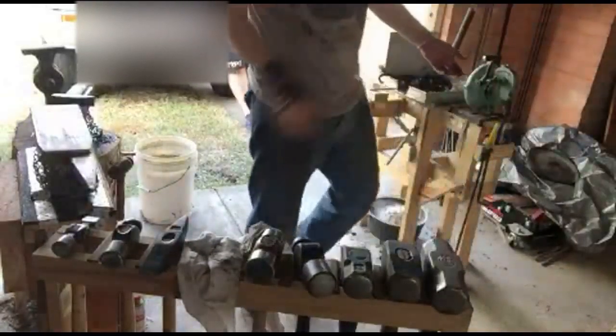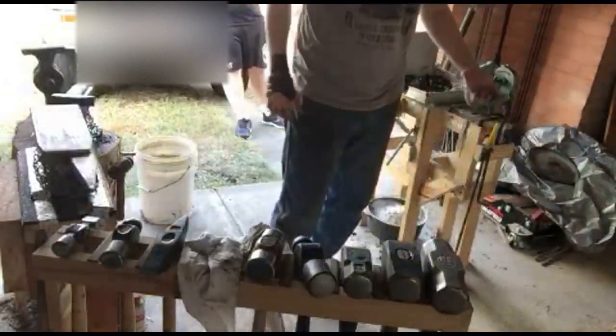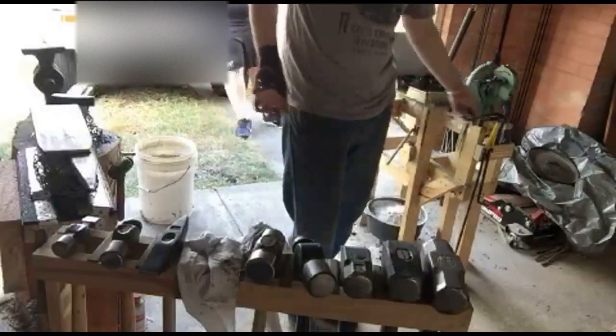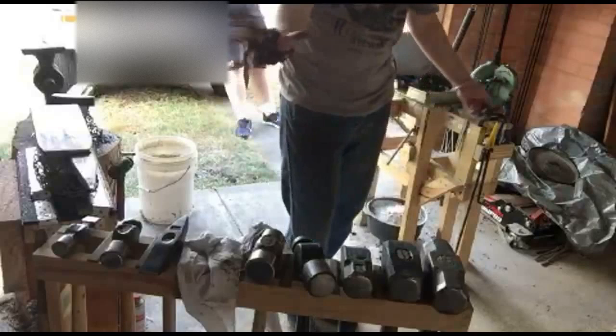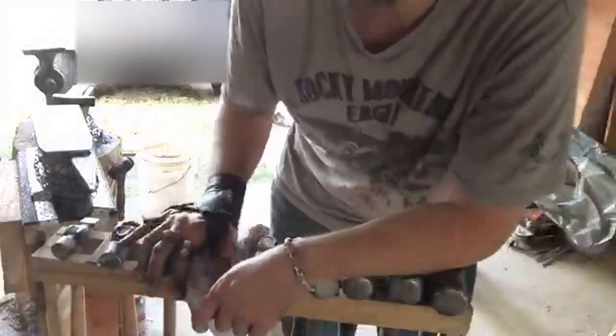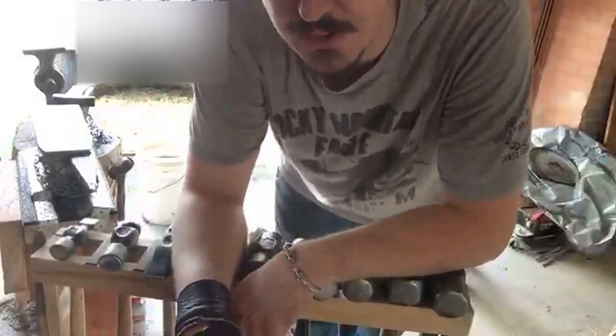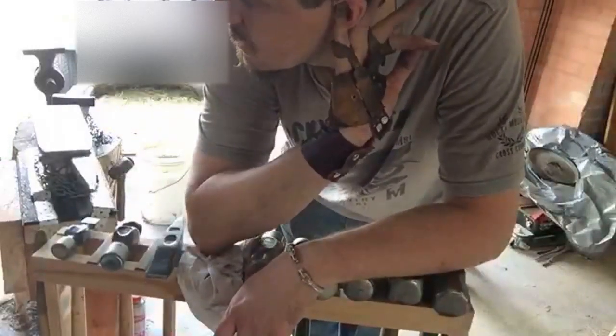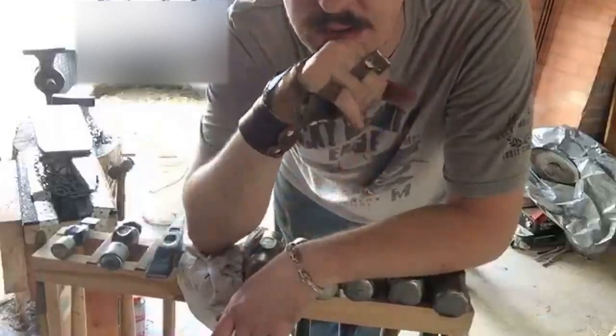So we're kind of taking turns in the forge. But when I made the eye loop for the hook before, I actually cut the steel short to the length I needed, and shaping it into that eye loop was absolutely mental trying to get it done. So I'm leaving a lot of extra steel for better maneuverability while I bend it.